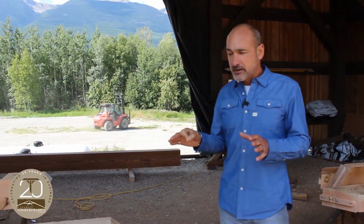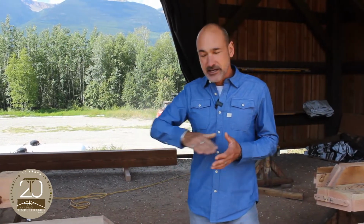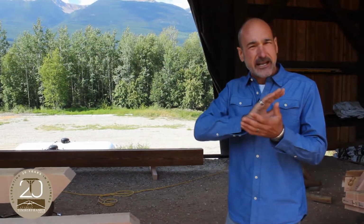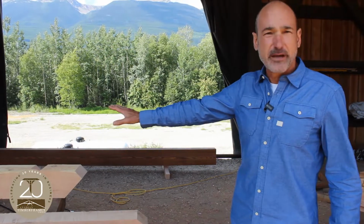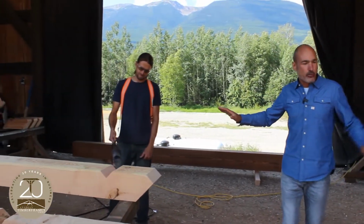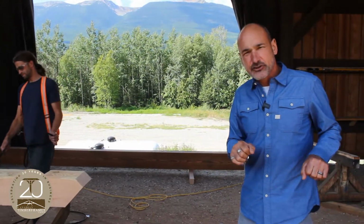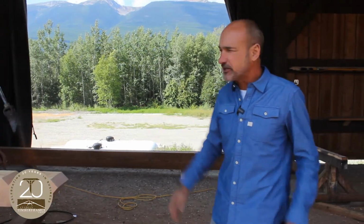Right now what we're doing, you've had the antique finish included in your frame that gives us that circle sawn look that you folks wanted. To help us set the pitch and allow us to take off some of the fur or splinters as we call them, we do a little bit of a burning with a torch. And then after that, we'll do a wire wheel and a polypropylene wheel to take off all of the excess splintering and loose material.